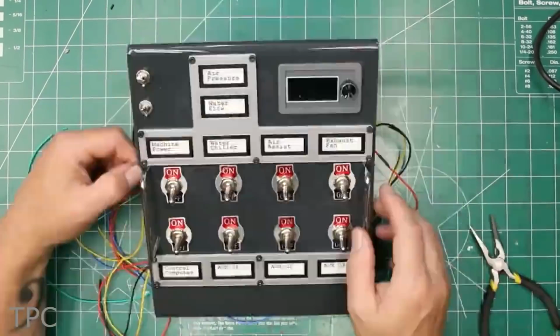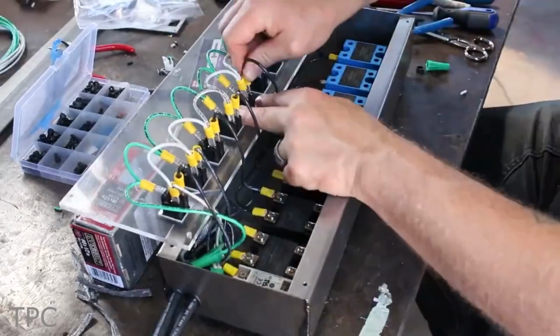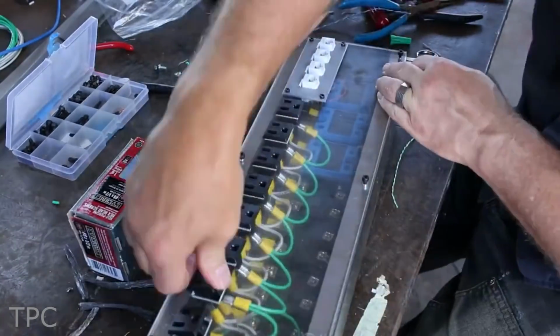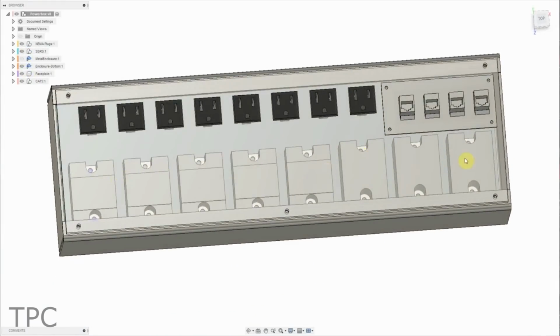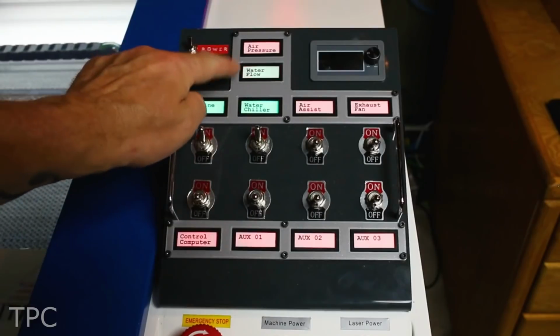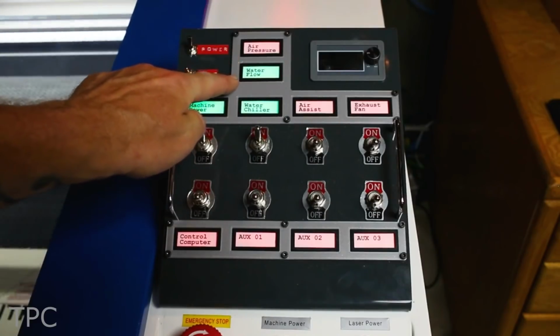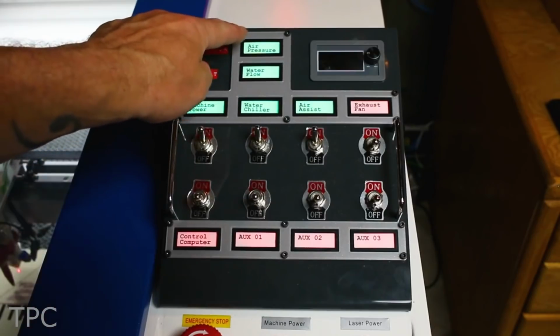Inside of the acrylic command station lies an Arduino Mega development board, which reads the switch positions and powers the various systems through relays. A separate sheet metal enclosure houses the relays, which connect to standard household-style electrical outlets. The Arduino also reads the sensors and controls the WS2812B individually addressable RGB LED status lights.